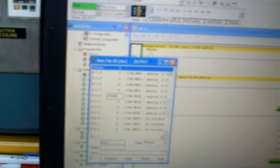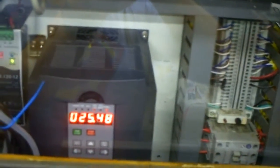Welcome back, it is Friday September 23rd, about 11 o'clock in the morning. We're going to do a quick update on the progress on the gasifier. I've got my PLC running, I've got most of my wiring done, I have my VFD wired so that I can change the speed of the blower on the laptop. We're running the big blower at 25 hertz right now.